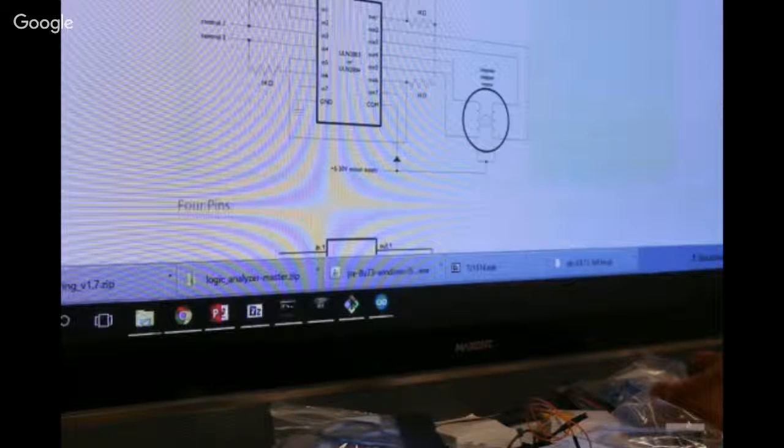Brush. Yeah, if it's brushless, you need an electronic speed control. Oh, we could talk about that. If you are doing something like a quadcopter that has a high power requirement and also a high control requirement, the electronic speed controller on a brushless motor lets it have a lot more longevity than would a brushed motor. And they also generate more torque. This is brush. It's got little physical carbon brushes touching the commutator.